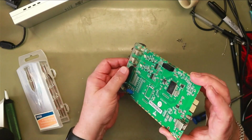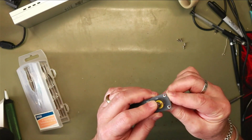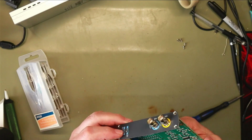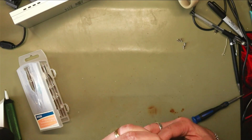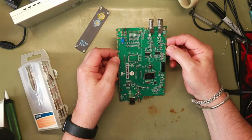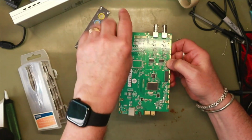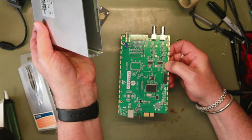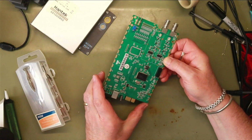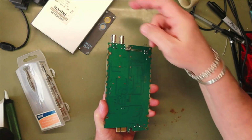But there's also some space here, which doesn't look like it wants to come off. No. It does if you push it. It's reasonably well made. It's got a spring on the back to connect to the back of that, because it's bare metal on the back. So that grounds the bolt or the 0 volts to the back of the box, and then there's a spring on the underneath that grounds to the bottom of the case.